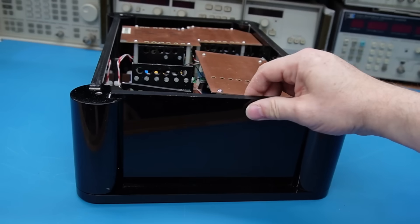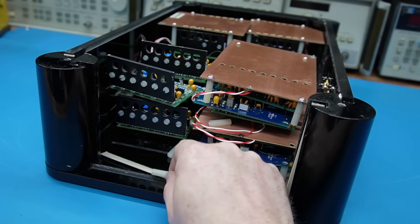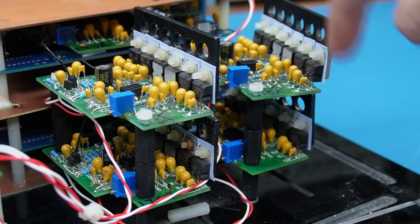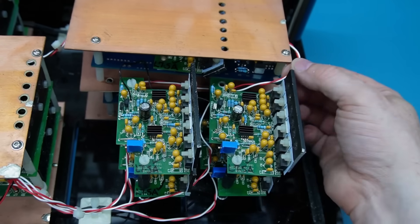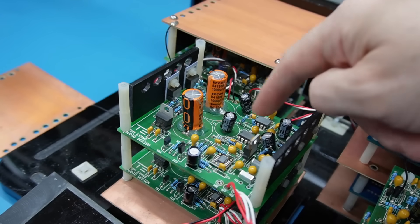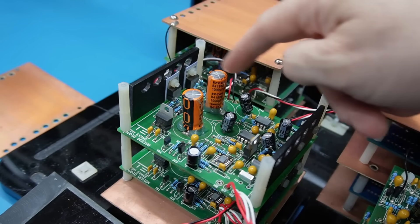Look at how many of those boards are connected together with standoffs, and did you see that cardboard come out of the case? These cardboard shims are meant to stop the case from rattling around, but dear oh dear. These multi-layer boards are comparatively very heavy — they've got huge heatsinks on them. You would expect build quality to reflect the price, and with such an expensive piece of kit I would expect these to have been more rigidly fixed so that even in transportation they don't come loose and break apart. But those plastic standoffs — I don't think they really stood a chance.